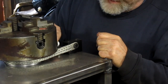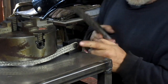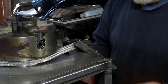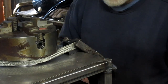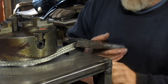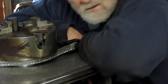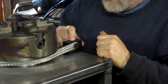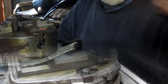We've got the ground clamps set up but not fully engaged. I want to be able to grab this bolt with the ground clamp, but what happens is it grabs fine and then drops down and bottoms out on the frame. I don't want it to go through the frame and the bearings, so we need to put some kind of protector right here. I think we'll go over to the mill and make a little piece — I have some Delrin — just a little protector to protect that edge.